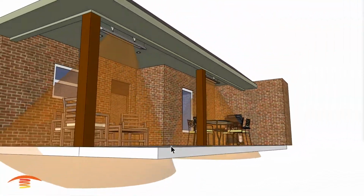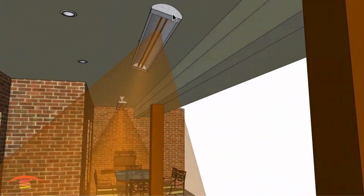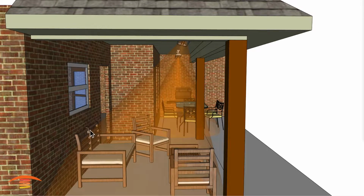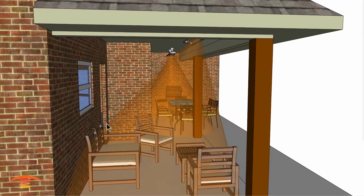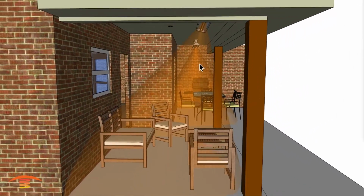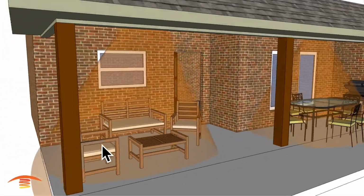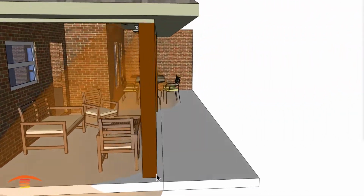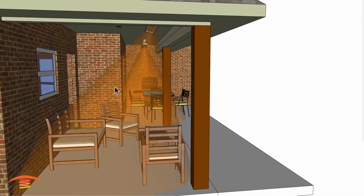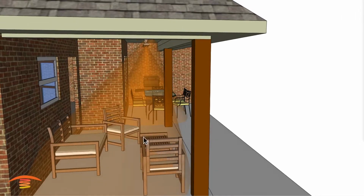However, we would have something off a little bit on the ceiling. This is mounted to the ceiling. I have it at a 15-degree angle, and that angle is hitting this chair fairly decently. I would probably want it a little bit higher, but if I did any more than 15, maybe 18 degrees would be okay. But then I would be missing this outer edge over here. So just something to consider. If it's primarily out the inside edge here, then you would probably want to put like an 18 to 20 degree angle here.